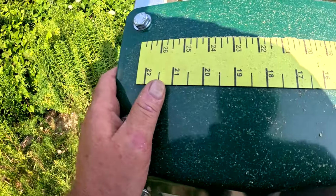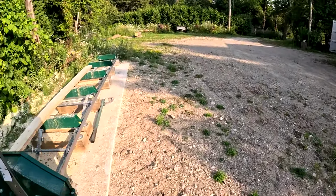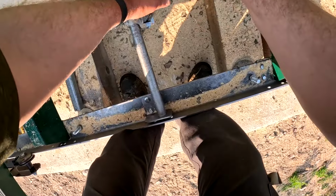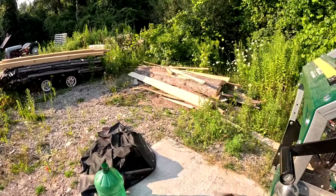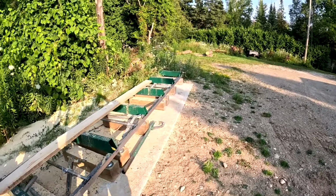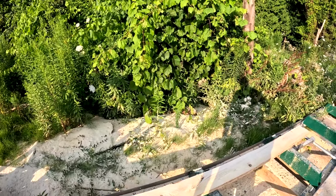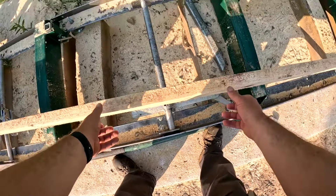Alright, shut her down, lad. Now we can hear each other talking. I like to measure this too and see if we scored or not here. So I'm going for the normal 6, but I'm doing, instead of the 2-inch, because it was brought to my attention that if you're going to use an air nailer for nailing four inches together, that's not gonna work. The nails for the guns aren't long enough. So that's why we gotta use this 1.5-inch.